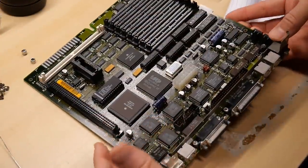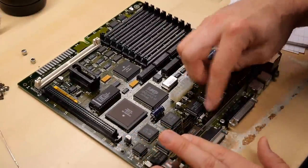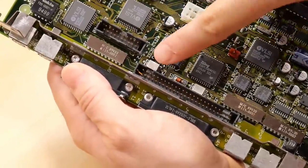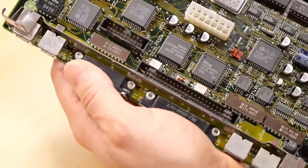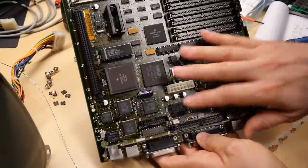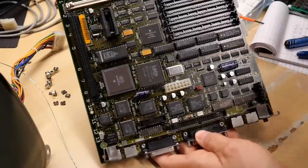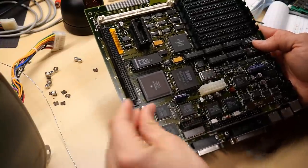And we're done — the board's recapped. It's all cleaned up and it looks good. I noticed one thing: there's a bent pin on the SCSI connector here. One of the pins in the row facing the back of the computer is sort of bent over and flattened. I'm just going to cut it off. All of the row on the backside here is ground, so one less ground pin isn't really going to matter — I'll just snip that. I soaked this in soapy water, toothbrush-scrubbed it, especially around these chips which had a little bit of blue corrosion. The pins are dull now but it certainly looks a lot better, and otherwise this machine I think is ready for testing.